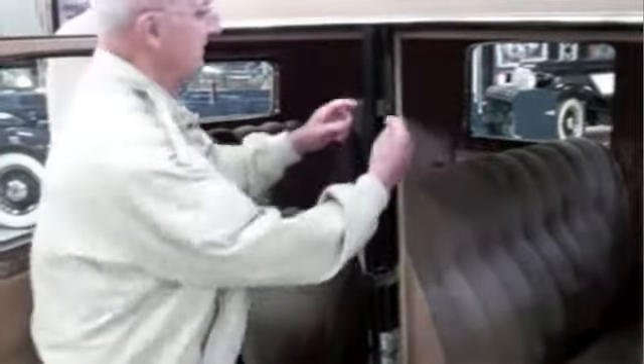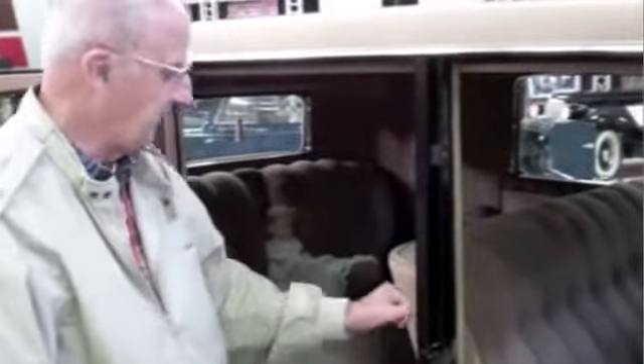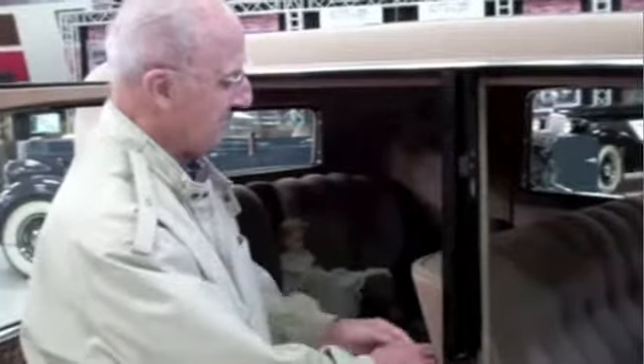As simple as it looks, this piece right here is probably my most challenging. I couldn't figure out how to make these cutouts in here — this is all wood by the way — and there's a little groove along the side here where this piece snaps into. It just drove me crazy trying to figure out the cutouts with the router and the band saw, but I couldn't figure out how to put that groove in. Finally I threw it on the back of the bench, and one night laying in bed I thought, I'm making a big project out of this. All I had to do was make it in three pieces, make all the cutouts, take my router and cut that groove in, and glue it back together and put some dowel pins in it. It was so simple after I figured it out, and it worked great.